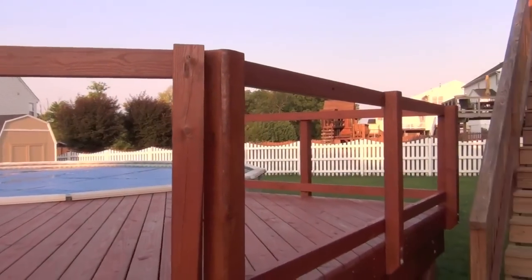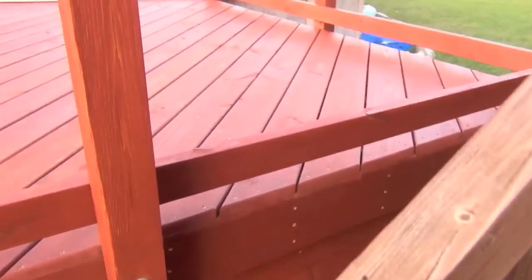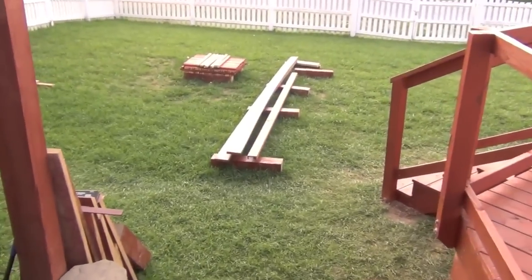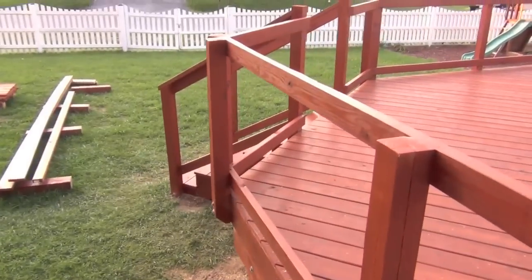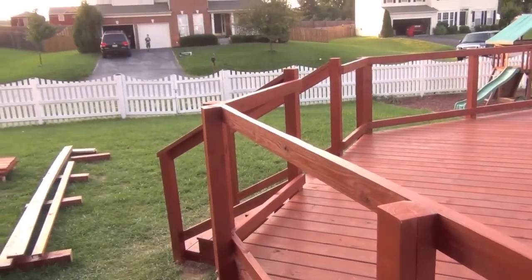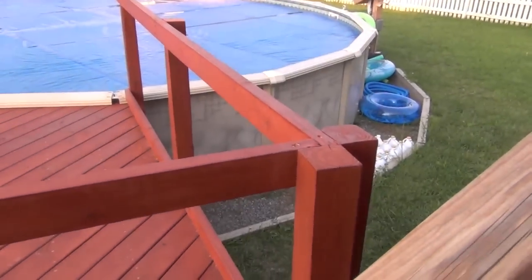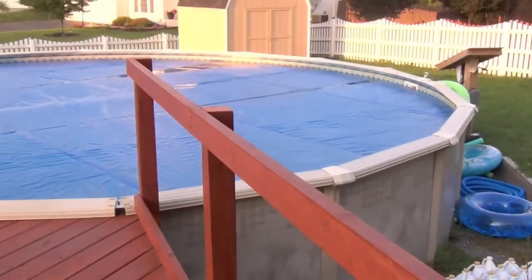And that's about it really — it's done. I just need to cap the top rail, put the balusters on, and then finish the gate, so that'll come tomorrow. My finger's starting to throb now so I'm calling it a night. I was going to use the deck boards, which are one inch or five-quarters by six, as my top rail, but I've decided to use the two-by-six instead — it'll be a little bit thicker. So I'm going to need to go get some of those. I have some measurements to do, go get those tomorrow, stain those so all my cut-ins are stained, cut everything flush.